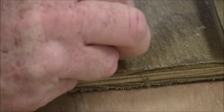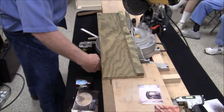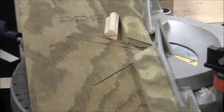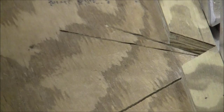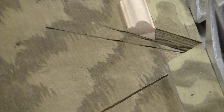This bench is heavier than those nice new-fangled things that fold up and carry around — those metal things with just a rail — but they don't allow you to put a table on it like this. This is just like a zero clearance table on a table saw. What's good about this is once I've made my cut, if I need to trim something up, I've got a line I can work with because that saw kerf is exactly matching up with my kerf. The problem with taking it on and off every day is that kerf kind of gets bigger as time goes on.